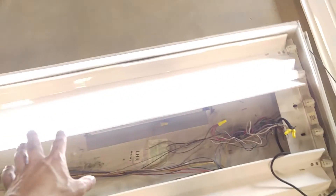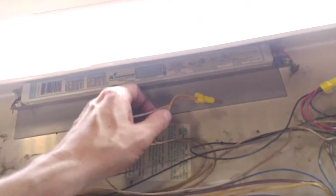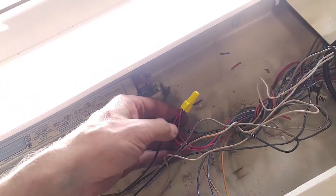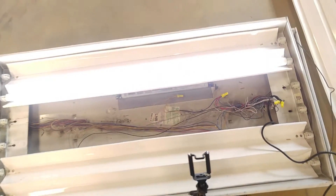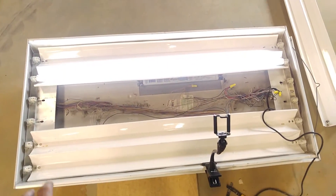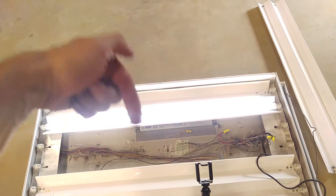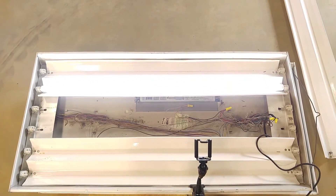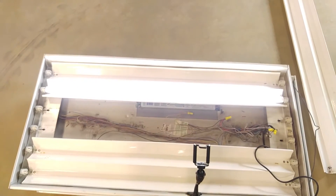You need to make sure that you've got hot going to one side and neutral going to the other, and you'll do that if you just follow the instructions: yellow to white and black to red, blue, and orange. It's pretty easy. If you're doing it up in the air on a 20-foot ladder you might have some issues, but it's very easy — nothing to freak out about. If you want to see reviews on the various LED light bulbs, I am doing video reviews of all of those. Make sure you check the links in the video description below, hit the thumbs up button, and subscribe to the YouTube channel.